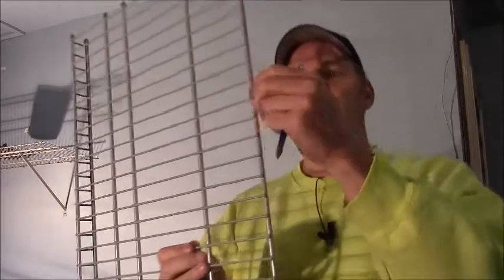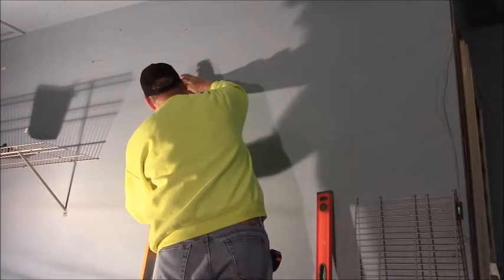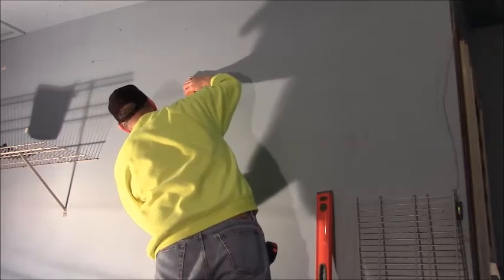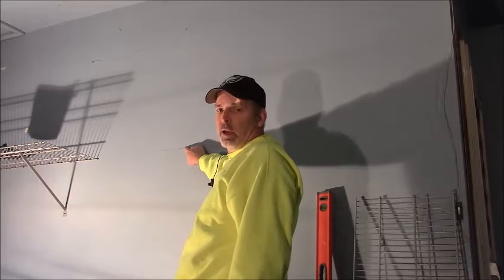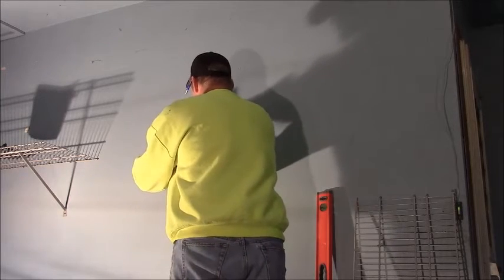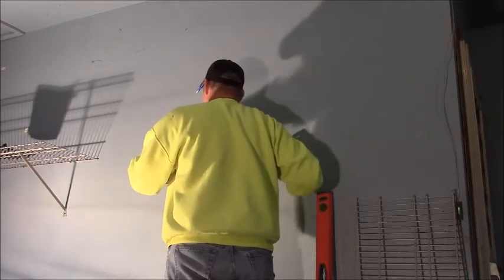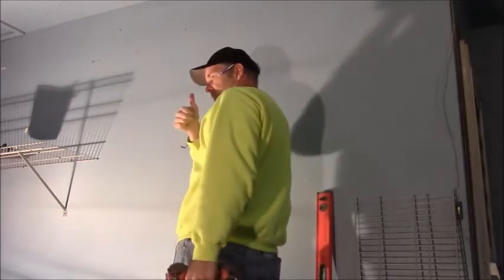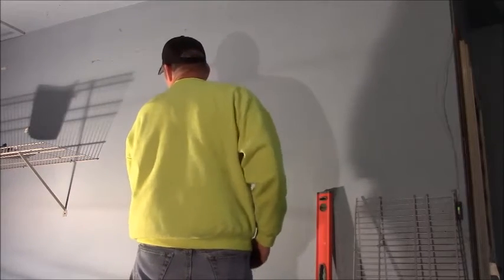On the shelf, they hang with these little tabs — that sets in the wall, and that's what hangs the shelf. So I'm going to strike a level line down from where I know there's a stud. I have a line right here, and I'm pretty confident there's structure there. If there's structure, this screw gun's going to start to ratchet; if not, it's just going to go right in. First try. So I mark my 16-inch centers all the way across.